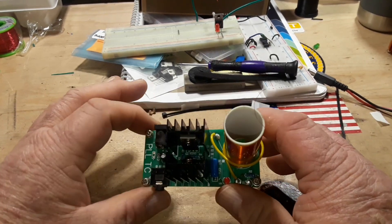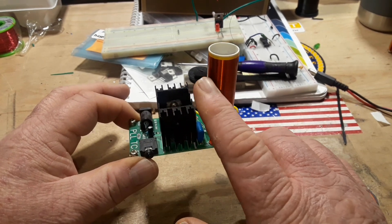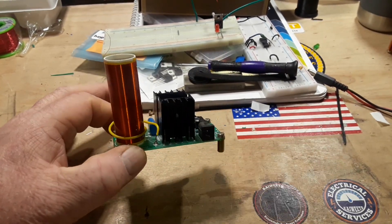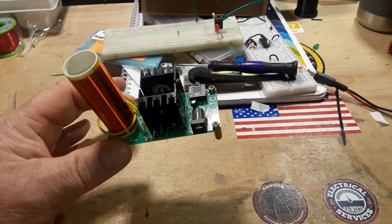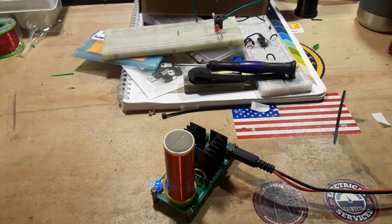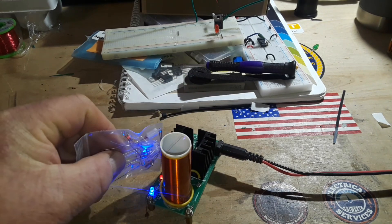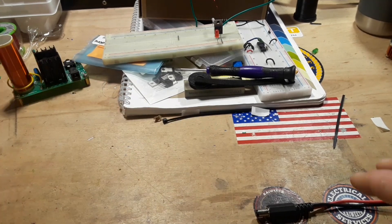This one I built a couple years ago. It's not strictly a Slayer Exciter because it has an extra MOSFET used to drive an audio wave over the Tesla square wave so we can play music through it. It's a very low-powered Tesla coil and doesn't play music loud enough to hear. It's supposed to run on 12 volts but I run it on 24. You can see there's a little coronal discharge — not much — and it really doesn't like to light up the neons. It's just a low-powered coil.